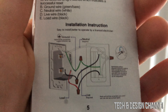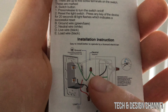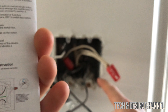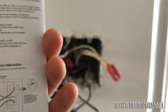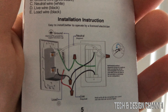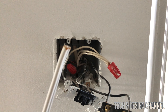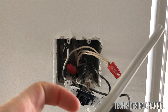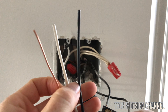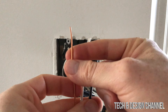My ground wires are very small, so I'm going to need to stretch that out to hook up my new connection. The grounding wire would be the green. We do have the white neutral and our live and load over here. Always take a look at the diagram and follow it. In my case I need some extra wire — I'll cut it here. Inside that cable I have three wires: black, white, and my ground.